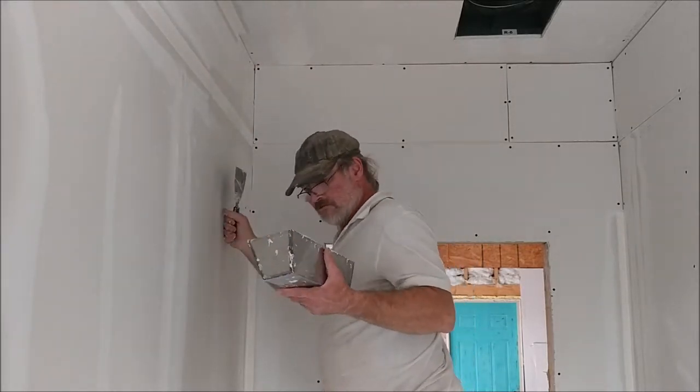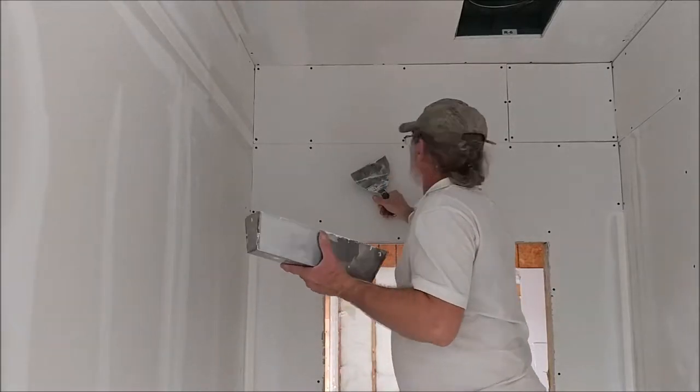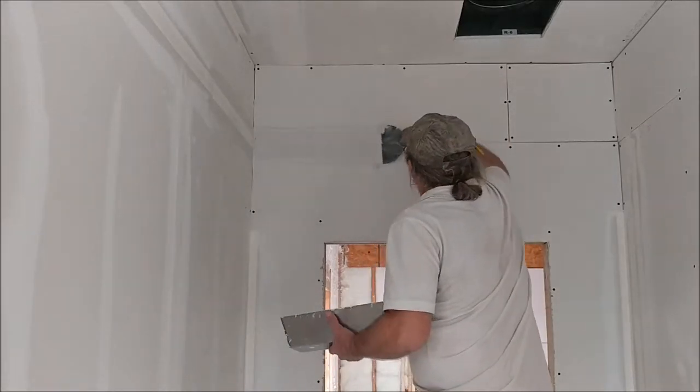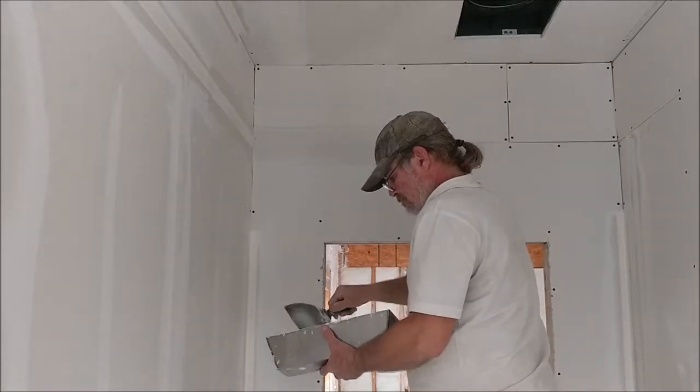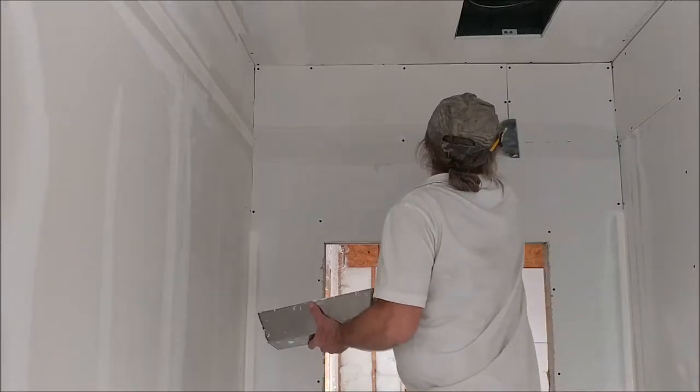Well, I'll do this other one right here. Maybe get a better view. A little bit of mud on your knife. Lay it across just like that. You don't want too much, but you definitely don't want too little. Just like that.